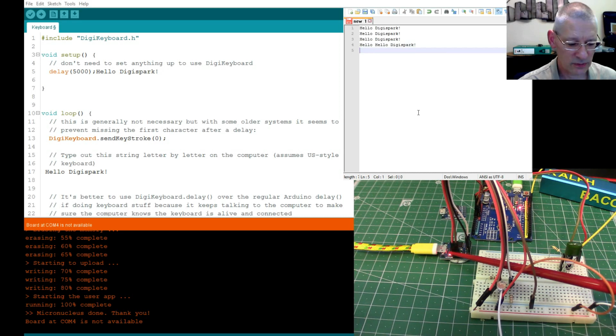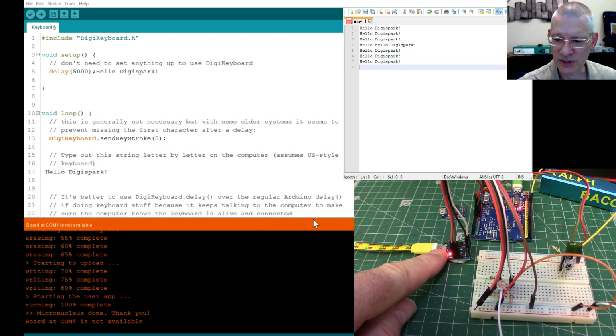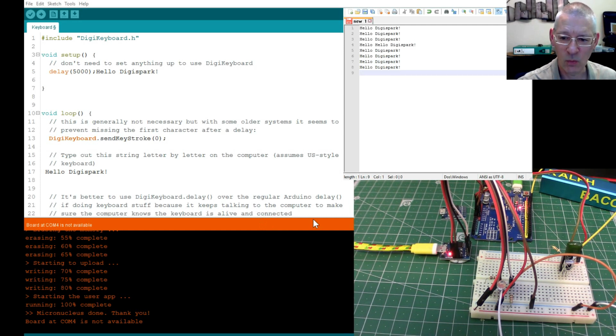Now as you can imagine, if you were to connect this inadvertently while you're programming, so you'd written some master program over here and you think, yeah, this is going to work on AT85. You plug in your USB port inadvertently without realizing you've got something like this silly program loaded, you're going to splat all over the top of it. So just be warned. Funny in this occasion, yes, but believe me, you will not see the funny side of it when you've written a very long piece of code and this starts putting these funny characters all in the middle of it. Don't ask me how I know that when I was writing my video controller. See, use my experience and pain to avoid it, that's what I say.